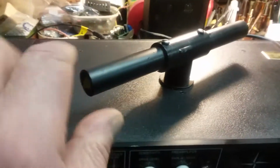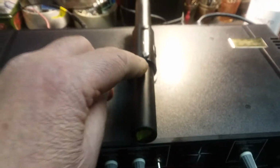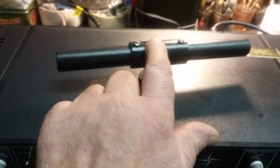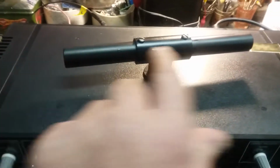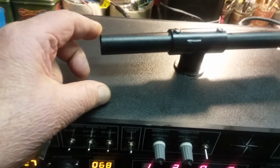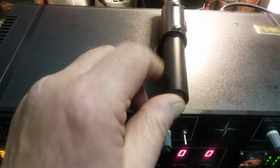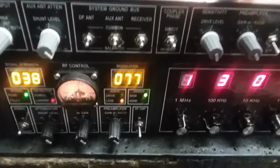The pickup coil in this doodad here, I'm running it to a reversing switch with an unbalanced loop here. If you remember in my other video, the resonant loop is dead center and then off to one side, and I forget which. I have the pickup coil, which is about 5 microhenries, 3, 4, 5 turns of wire off the end, which is the 90-degree differential from the center to the end. You know, the voltage current thing.